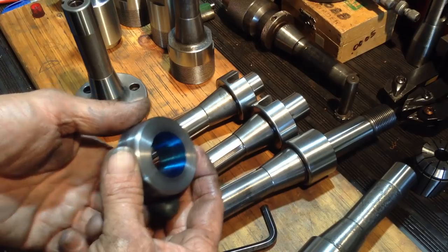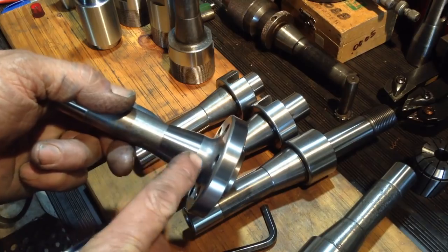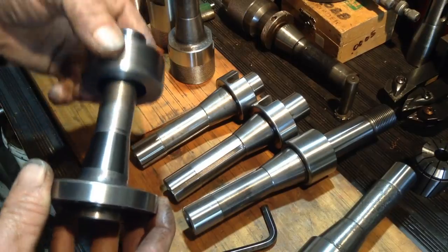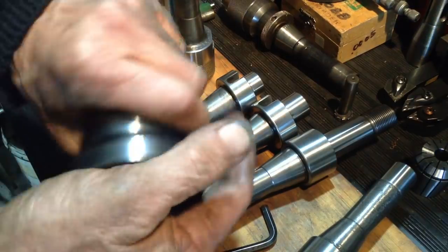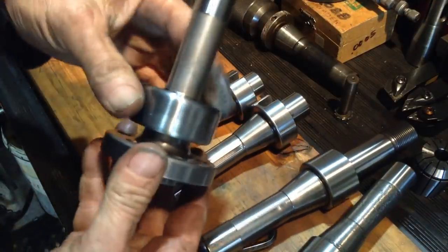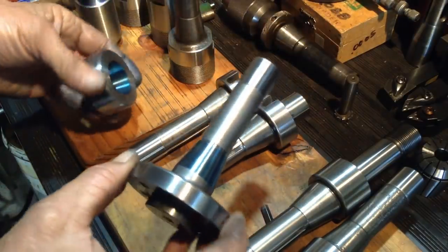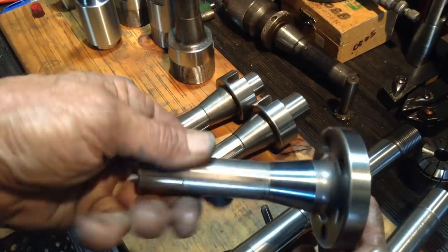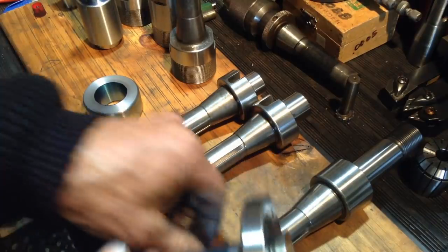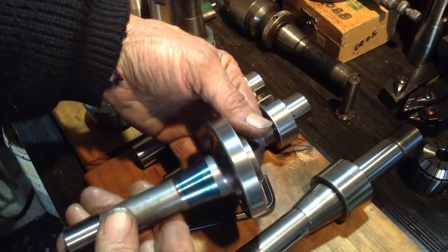Okay, so we've blued up our ring again, and we put our face mill arbor back in after that last adjustment. So we'll see how she's looking this time. But I think we're pretty confident we've got to be really close, so we'll pop her off. And that's exactly what we're after. So we have that blue tinge coverage the whole length of the taper.